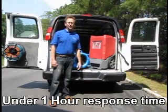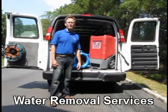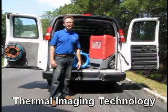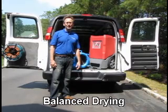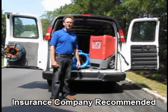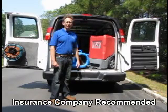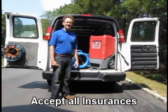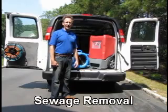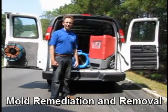The third principle is dehumidification or balanced drying. The dehumidifier is used to absorb the moisture from the air. This is a dehumidifier that we would use on a typical job. This dehumidifier is capable of extracting over 10 gallons of moisture in a day. We would use as many dehumidifiers as necessary on a job.